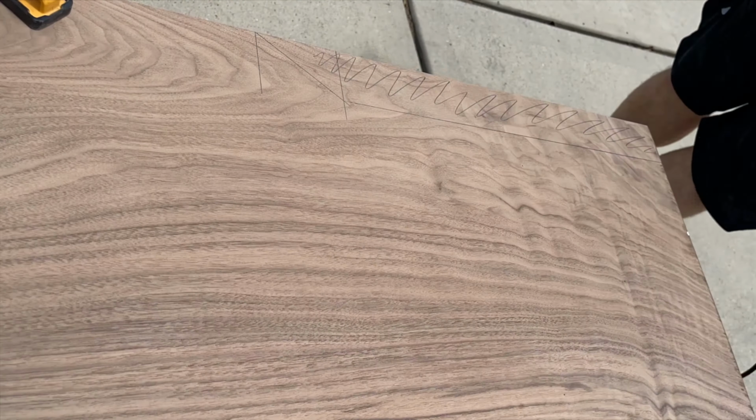That was not the case, and that was not my experience whatsoever. It removed the wood in a very gentle way, and it is an aggressive tool, and if you try to turn it on its side, it will gouge the wood very quickly. So I found that using it on a flat surface, using the broad side of the tool, made for the best look so that you didn't have gouges in the wood. And I was able to remove quite a bit of wood in a short period of time.